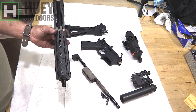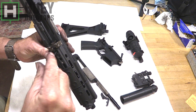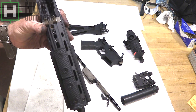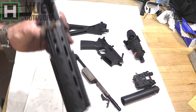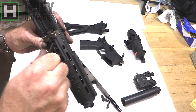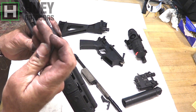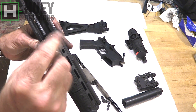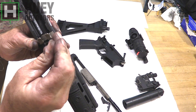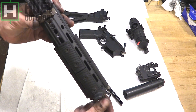When you're tightening this screw, you can feel it go all the way until it stops — but when you get there, that's too much. See how the barrel with this delayed blowback system should be moving. All you want is just a very tiny little bit because you want that play. You want it to move like that. It doesn't need to be any more than that. You don't want it tight because it will affect operation, and you don't want it too loose because it will affect accuracy. Just a hair and then it's perfect.